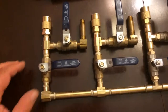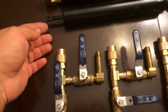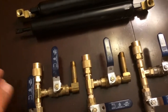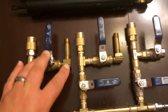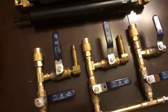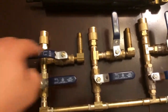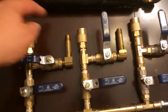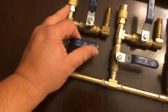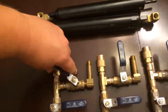Both lines are closed off right now. What you do is charge the air — when this happens, the shaft inside the cylinder will extend, shooting out. At that point you cut off the air supply, and the shaft stays out because there's still air pressure in the hose to the cylinder. Then you release the air, which comes out the exhaust port, and the shaft returns back inside. Close that off and do it again.